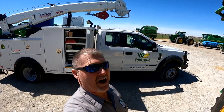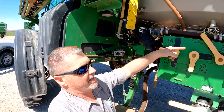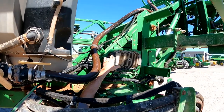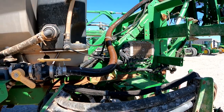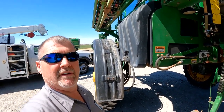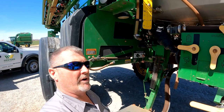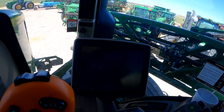We overlaid a new wire for the 8202 circuit from the XX56 connector along the chassis back to the sprayer rate controller, into the number one connector for the unswitched voltage for the sprayer rate controller. We're going to start the machine up and make sure we've eliminated fault code SR1 168.04 — the unswitched voltage code. It's a little windy out here in southwest Oklahoma today.